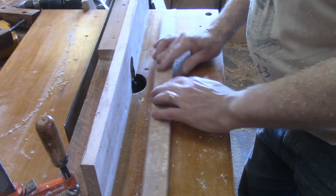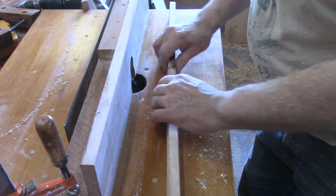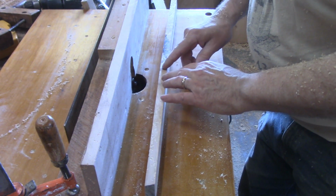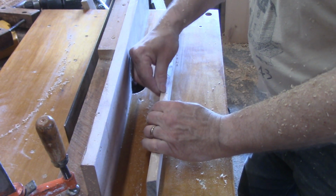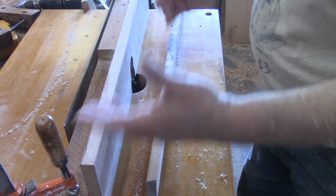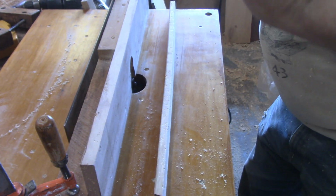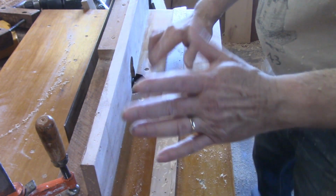These are really simple. Before I assemble them, I'm just going to miter the corners and glue and put some brads in. And the bottoms, I'm going to put a little rabbet in so that I can glue a piece of 1/4 plywood in. Then get some finish on it and get it home, because it's a quick project. But this worked out well so far.